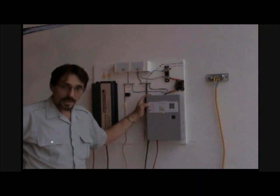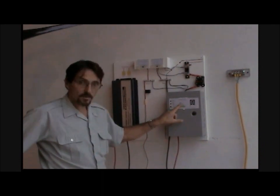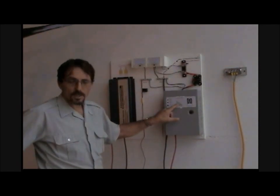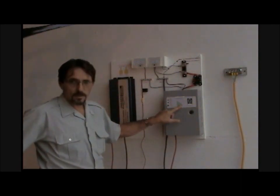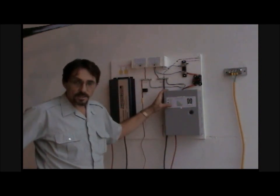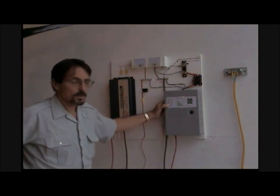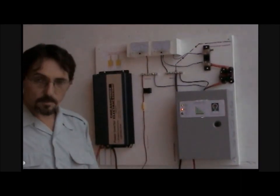The flashing green light here tells you how much the battery is charged up. One flash, it's low. Two flashes, it's 20% full. Three flashes, 40%, and so forth. When it's solid green, your battery is 100% full and it's ready to dump the load, which basically means cut the power off coming in from the wind turbine or solar panel. To test this and make sure it's working, you hold the button for two or three seconds — and that means it's dumping the load.